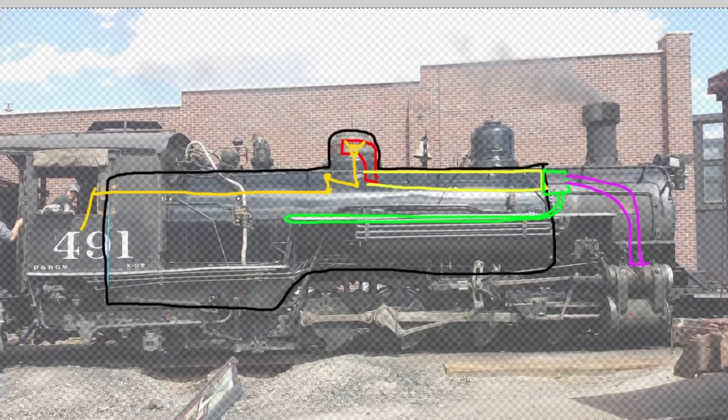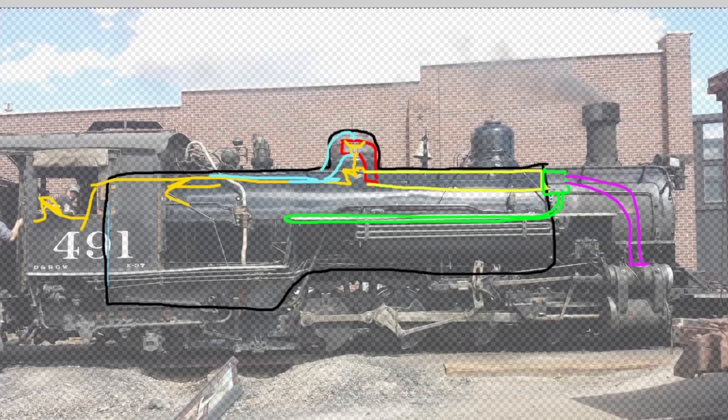In level four, we understand that the boiler has what is called the steam dome, and inside the steam dome lives the throttle body. The throttle valve is controlled by the lever in the cab — as you pull the lever out, it pulls on a rod, which pulls on a bell crank, which raises the throttle valve. When the throttle valve raises, steam inside the boiler is allowed to enter through the bottom and top — two different seats — and flows through the throttle body into what is called the dry pipe. It's called the dry pipe because you hope it remains dry.